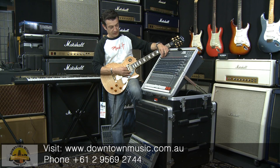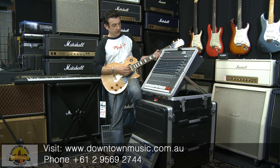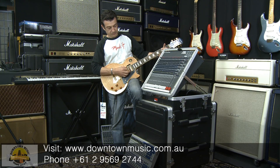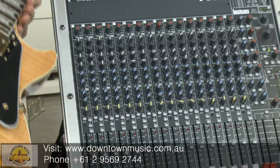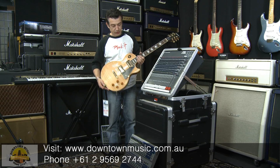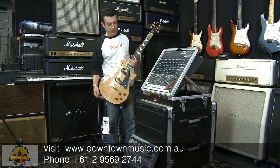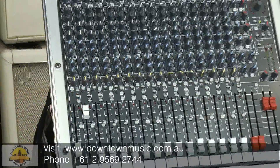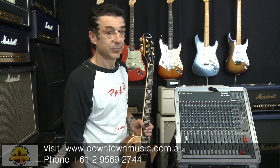Watch this. As we come to the 3 o'clock position, the red light comes on. So it's a little bit back — just a little bit back. Now that second channel has been set up for an electric guitar. As you turn up, the master volumes in the second channel — that guitar — you'll be able to hear it through the PA. Never have to run your controls right up on a mixer. If you're starting to do that, I think you've got your inputs and output gains set up incorrectly.